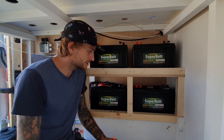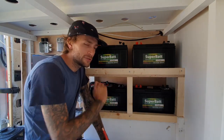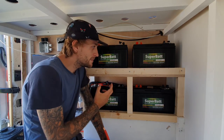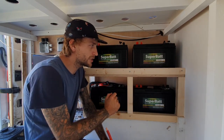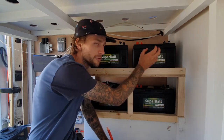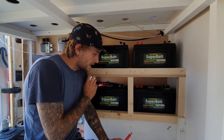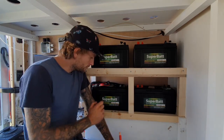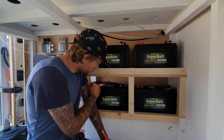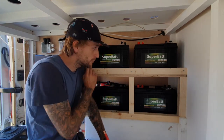I thought I'd run through how I'm connecting my batteries up, because you can mess this up and it can be quite dangerous. I'm connecting my battery system with multiple batteries in parallel. What that means is the 12 volt batteries connected together in parallel will still give me a 12 volt output, but with every battery connection I'll be increasing the amp hours — 120, 240, 360, 480 amp hours — while keeping it at 12 volts. When connecting your batteries, you want to be extremely careful not to short out any of the battery terminals across the whole system.